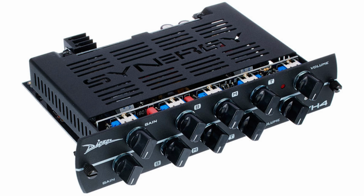And of course, with all the other Synergy modules, the knobs are diagonally arranged because the size of the actual potentiometer inside on the circuit board is big. And they need to get the knobs close enough together to fit on the panel so they don't overlap the panel. So they staggered them so that the body sizes of the pots would be like this rather than like this. I thought that was fine, except that overlaps this rectangular area I need to squeeze an EQ in there and get small enough sliders to fit in there, but I also have to be wide enough apart that you can actually grab them individually. So I need some real estate that's not available using those pots. And that's why all of our modules have the pots stacked vertically on top of each other,